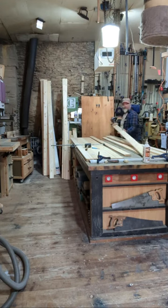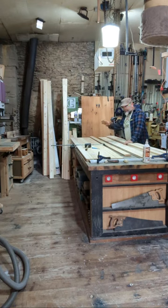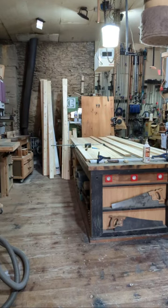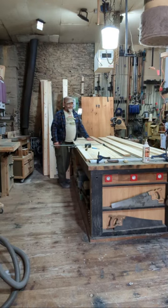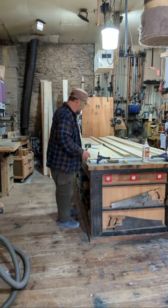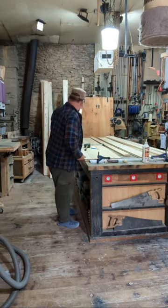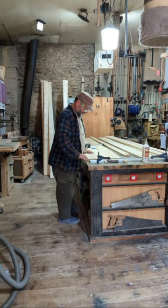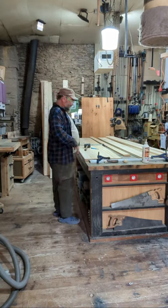That way around. Nope, that way around. Hope we get this one together without it being an issue. Because, as I mentioned a minute ago, once it's clamped together, it's tight. The clamps will be released, obviously, because you mustn't have them clamped tight when you glue them up. But as long as it's touching there, and touching in the opposite corner, and vice versa over here, because the bench is flat. The bench is perfectly flat, so I know the shutter's going to be flat. Also, one thing I haven't done, and what I normally do, is with this edge board here, because I set this stop perpendicular, 90 degrees, to the edge of this side. As long as I clamp this down here, I know that when I tap all these boards up to the stop, they will all end up square on the end. That's pretty much what you do.